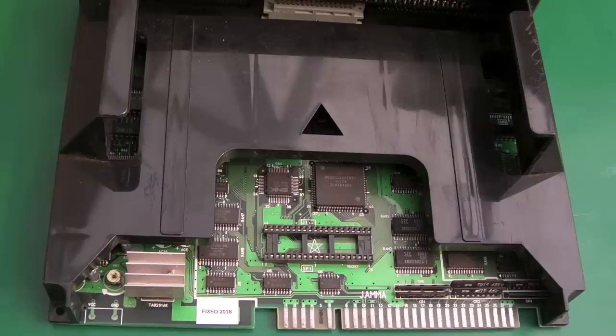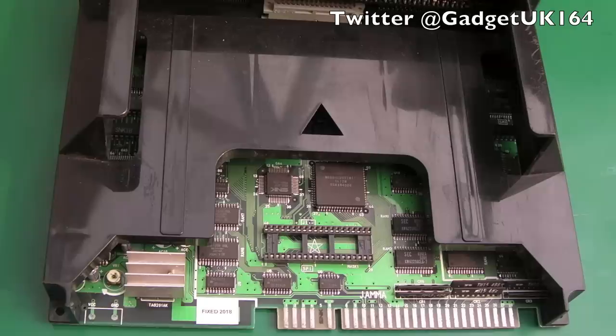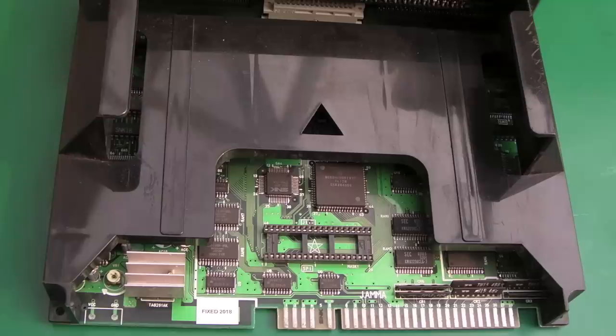This is a Neo Geo MVS, it's the MV-1A. It's not got sound, so I'll show you in a second. It's playing games okay with a Unibios there. You get a Z80 error, I think, if you use the official BIOS, but the Unibios, as default, will skip past that error, and you just get no sound. So straight away I'm thinking, could be the Z80, the YM2610.